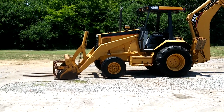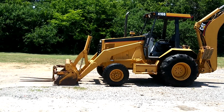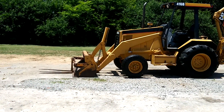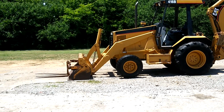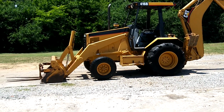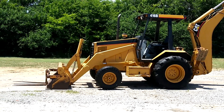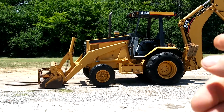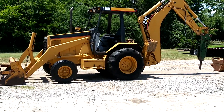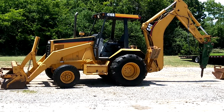The only thing wrong with it is on the front bucket — there's a single joystick to raise up and down or tilt. If you try to raise the front bucket straight up right now, it'll just barely come up while you're holding the valve up. But all you've got to do is tilt the front bucket and it'll raise right up and pick up weight. I'm pretty sure it's something to do with that joystick — it's not the hydraulic pump because she's stout. The backhoe works flawlessly. It could be the seals bypassing the cylinders, but if you tilt it, it picks right up. The transmission shifts good, she runs good, outriggers work, and the jackhammer works.